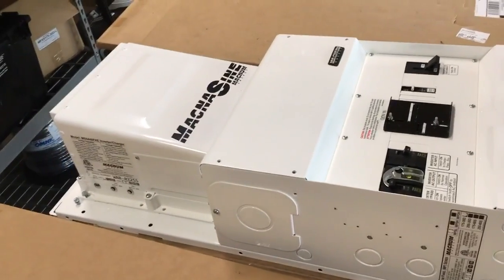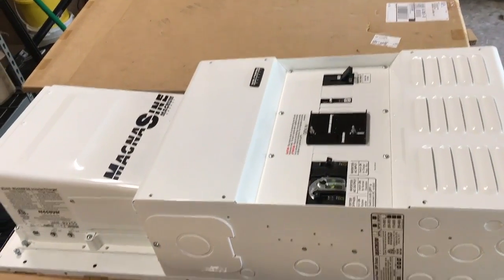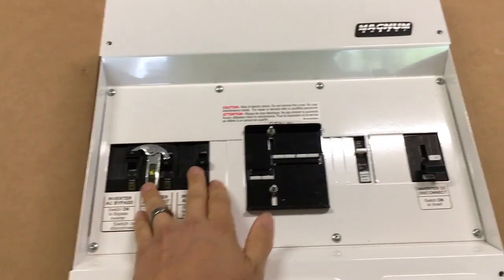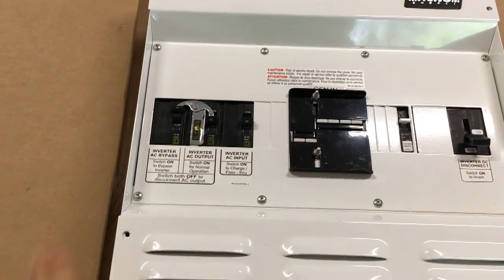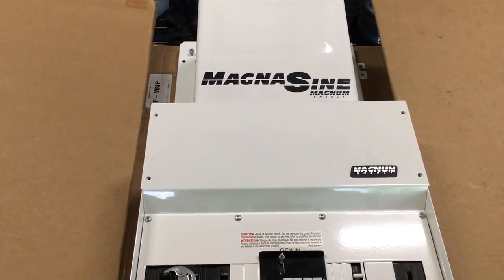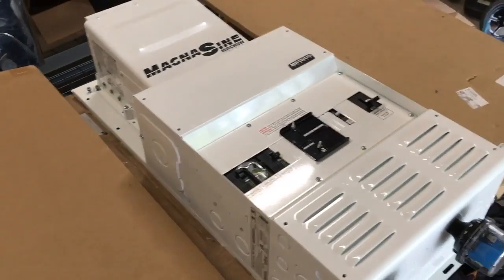Here's the backplate. What you can do is take the Magnum inverter, buy their interconnection equipment, and you can have all of your AC breakers and DC breakers — there's din rail and stuff in there. You can have all your interconnection equipment right where the Magnum goes, so it gives you a really clean, seamless look. In a lot of my videos you see me using the MMP 175-30D — the smaller Magnum mini panels — on straight systems.